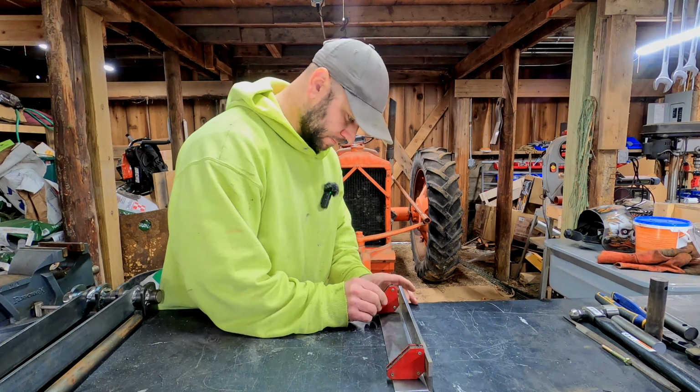So essentially this is what we're trying to create. We're going to make some supports here, but as you can see, the cylinder is hitting my back plate here. So I need to lift this up so I can get those supports back and get this radius to clear this back piece. And I think I'm going to do probably 1 inch taller. Got some of those 1-inch spacers here. And that looks like, yeah, that gives me about a 1/4 inch clearance underneath there, maybe a little less, but close to a 1/4 inch. And it gives me plenty of room for this to pivot without contacting. So yeah, I think we'll make these supports 1 inch taller than we made all the arm supports.